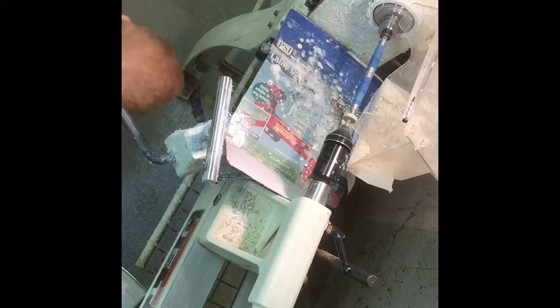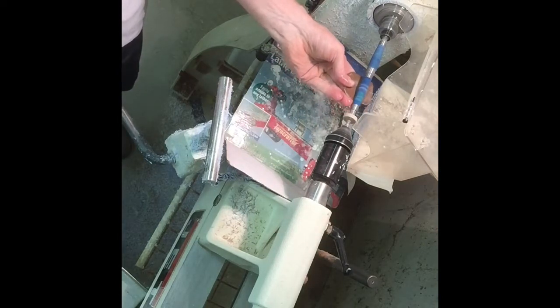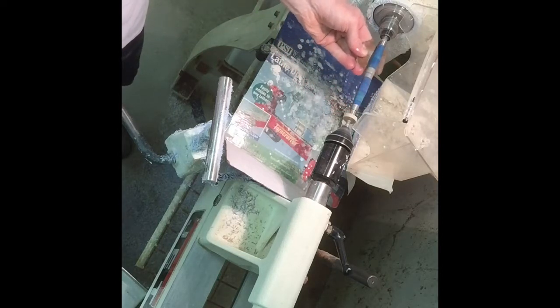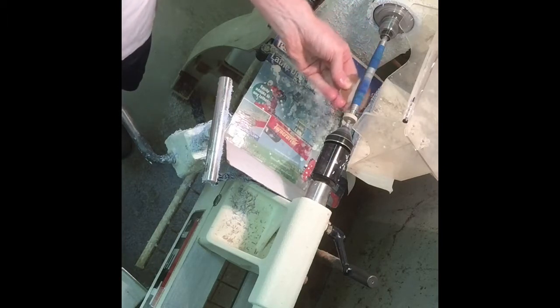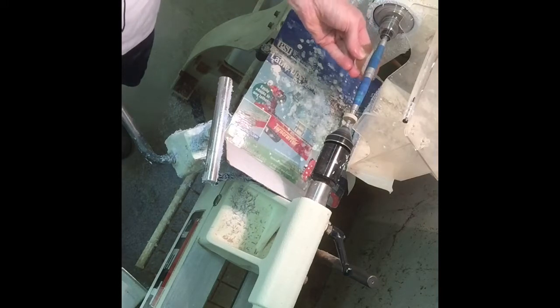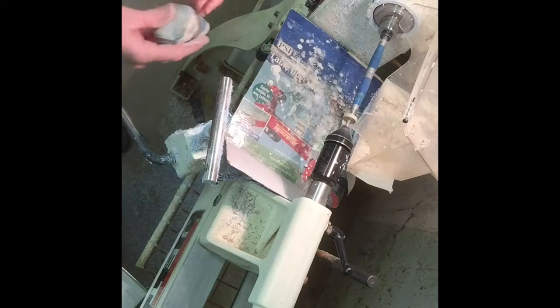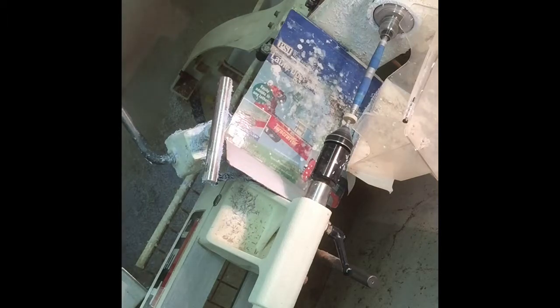Let me get my water a little closer — it's on a separate workbench. Start with the brown side. Just want to make sure you cover all your areas. The older sandpapers used to say you had to clean off between each grit — take a paper towel and get any leftover pieces of grit. But the newer sandpapers, you don't really need to do that. They hold on to the grit real well and aren't leaving much on the material, so wiping off between every grit hasn't been a problem for me.